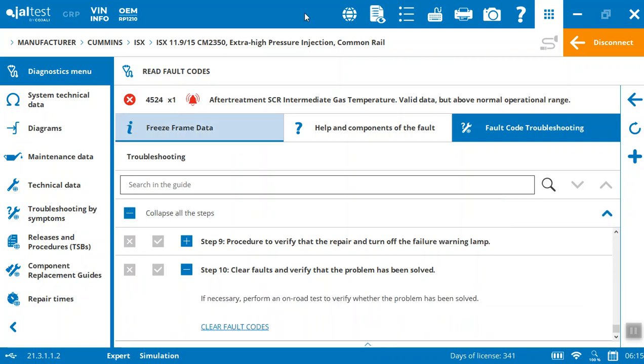This process was a manual sort of diagnostic, but on on-highway vehicles it's a full automated scan of all systems inside the vehicle. We're specifically just here in the Cummins engine having a look, but when you actually plug into a truck and hit scan, it's going to read everything and give you the full fault codes.